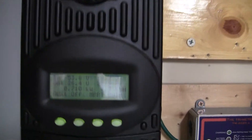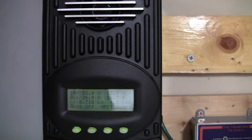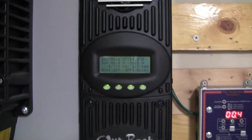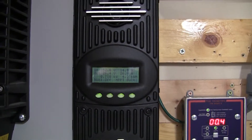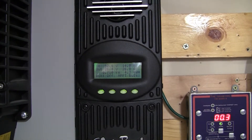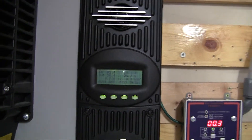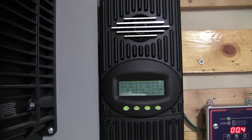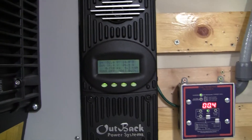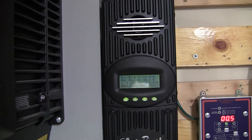Right now we're going through 700 to 710 watts. I like to do that around August. August to September I'll tilt them up to about 30, 32 degrees, and then probably around end of September I'll go ahead and tilt them up as high as they can go, which I think mine can go right at about 40 — I want to say 42 or 43.